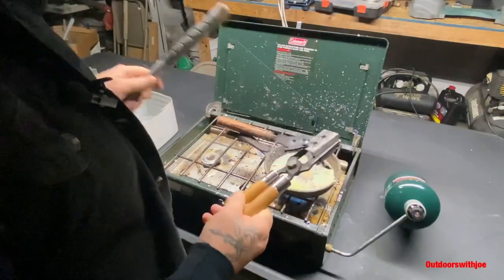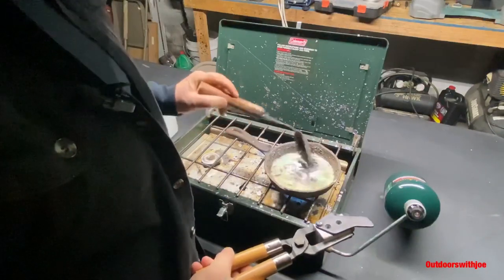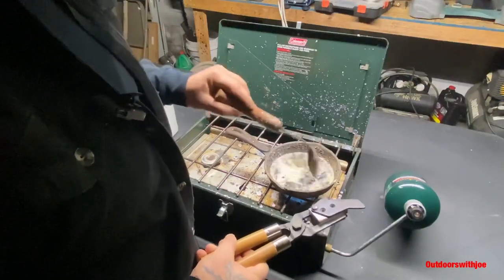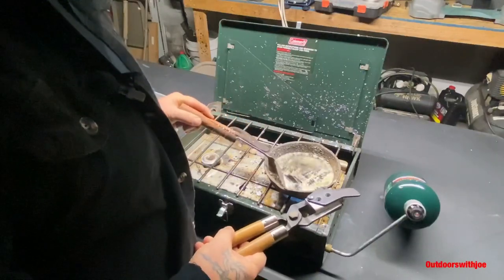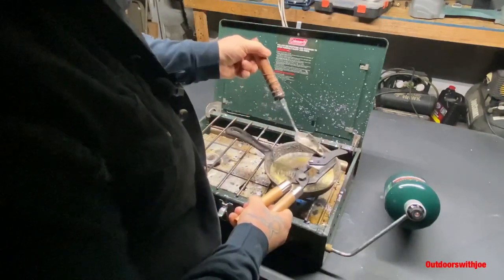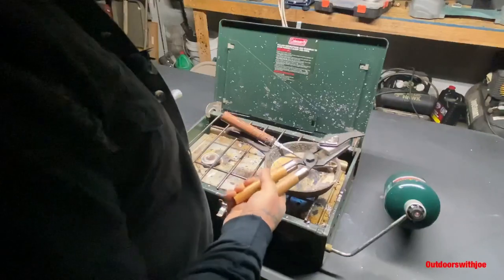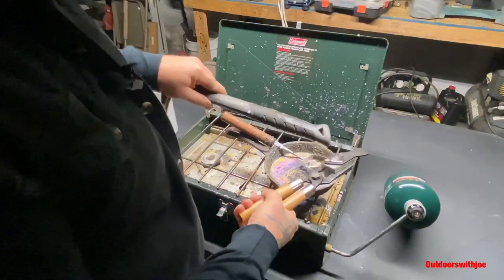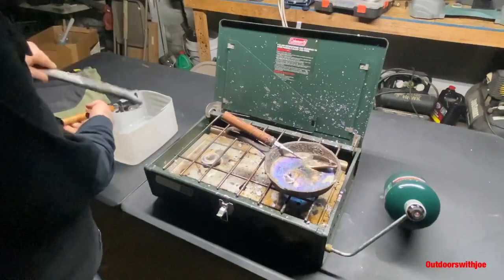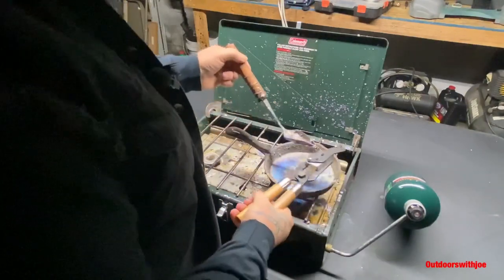Be careful folks, these things get hot. Let's cast a few bullets. My ladle — it's still got a little bit of slag in it, so let's get a little more slag out first. Pretty simple — just pour your lead in it, give it a second to cool. Now be careful when you take this off — when this piece of lead here drops back down in it, just be careful it doesn't splash back up on you. So we just take that off, drop it in, tap our mold, drop our bullets out. And it's just a repeat process — it's not rocket science.